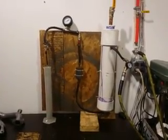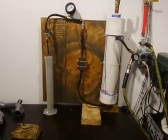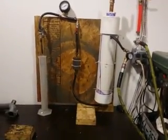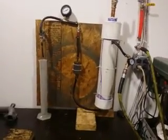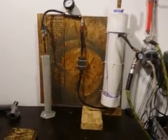With this setup, I made it so I can pressurize the system, have two, six, eight, however many injectors, flip a valve, and they start running at a given pressure. As that pressure gets depleted, it's replenished by the air compressor here at the shop, so I can accurately flow test and clean CIS injectors.